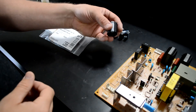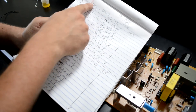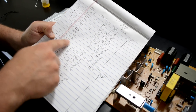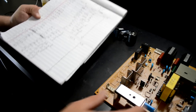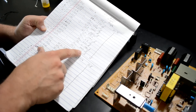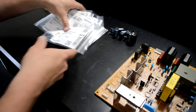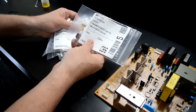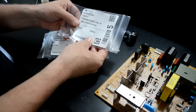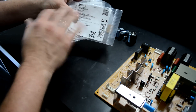I've got the stack of capacitors. Before I removed them, I went through and recorded the value for each capacitor on the power supply unit manually, writing down its position. That way I can pull them all out and use my key to put the right capacitor back in its spot. I had to individually order these from Mouser — you can use any site you want. I don't get any special deal from them; it's just the one I've used the longest and have the most order sheets set up with.